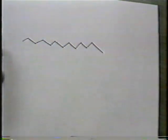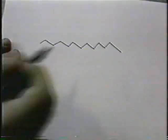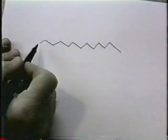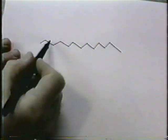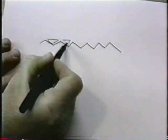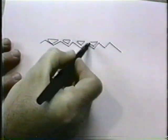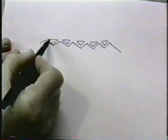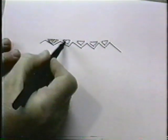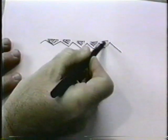Now here's the reason it's important to understand that you need flat wood before you can start a good finish. If you start with raw wood and then apply a finish, the first thing you have to do is fill in all these gaps. You're either going to fill them in with filler, talc, dope, whatever.